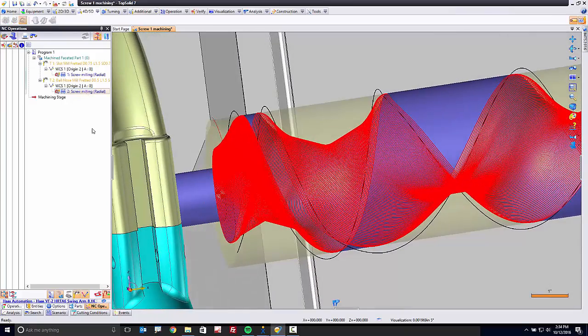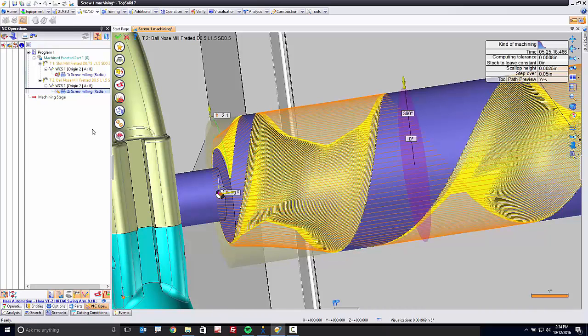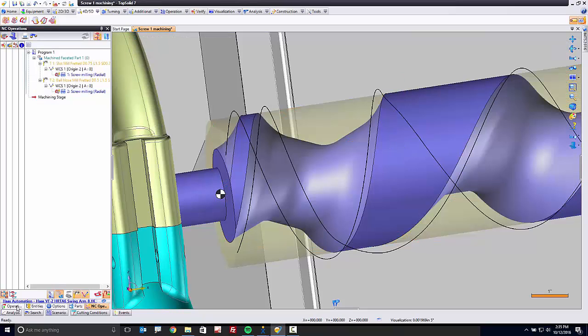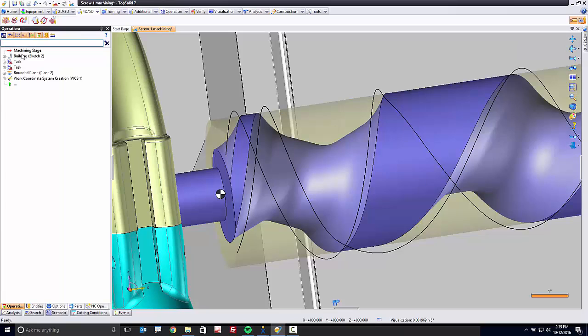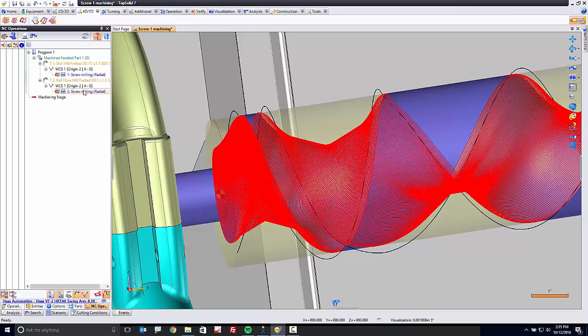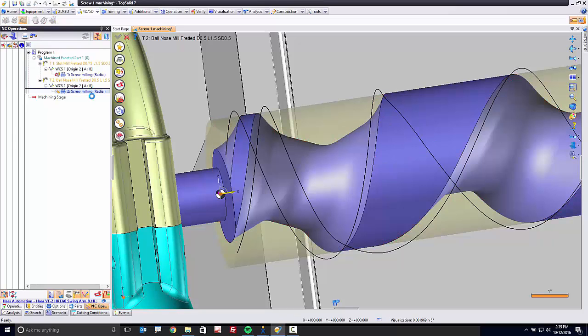What I'm hoping to do is optimize the toolpath a little bit so that I get to cutting and finishing that much more quickly. So to do that, all I have to do is change my curves. And I apologize. I made a mistake. Mistakes happen. I have to put my curves before the machining task in history. Since we're a parametric software, things have to be done in order. Makes sense. So I'm going to go back and edit this now, and let's go edit our boundary curve.